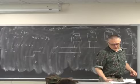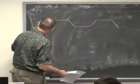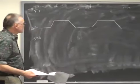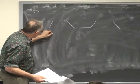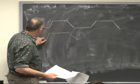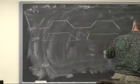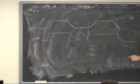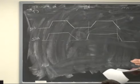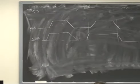So the way you signal all this stuff is, if this is SCL, the clock, and this is data, then the data line has to be stable at either a high or low value before the clock is high. So it has to be stable before the clock is high and after the clock goes low. So the data has to be stable all the time the clock is high. That's used to signal both addresses and data.